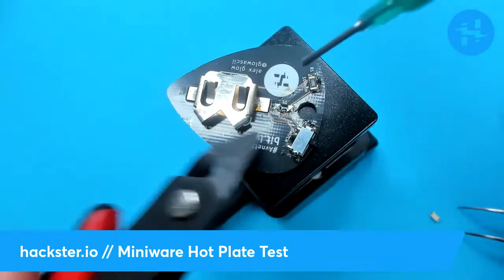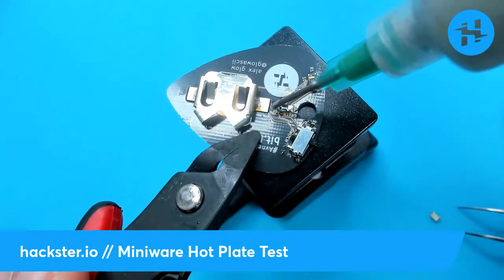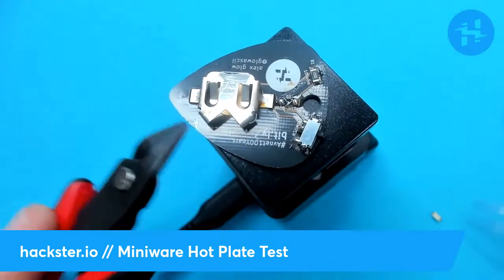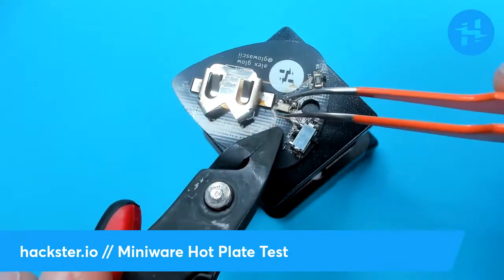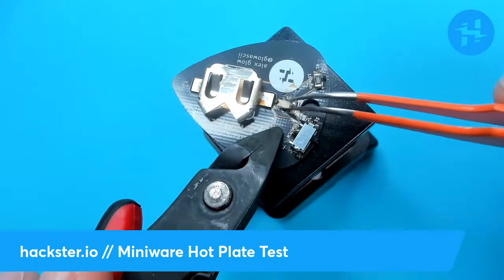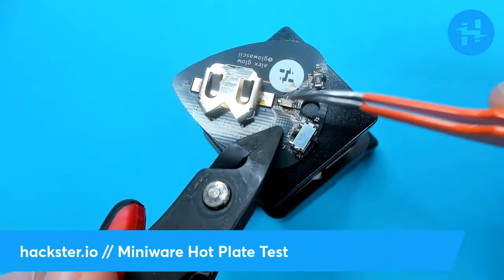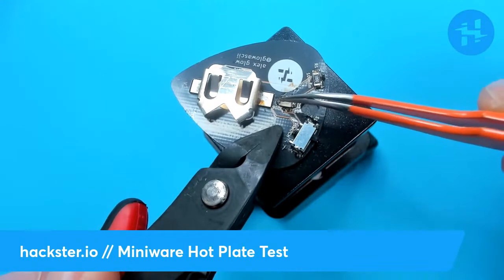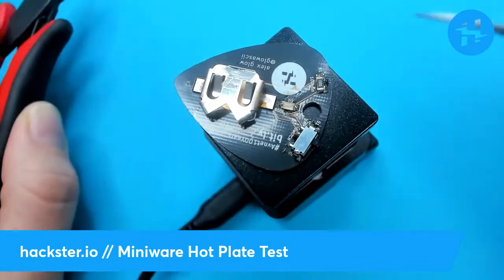Another one that I want to do is Oshwi, the octopus badge by Gustavo Reinaga — you can find that on GitHub, which is linked in the description below. I'm not going to do that today because I think I need to do a little bit more practice with small boards first and get used to the process of handling these things. You saw that I accidentally knocked the board off of the heater before, and that's not optimal. I need to get used to this before I do a larger board and come up with some strategies around that. Oshpark is wonderful — I get a bunch of my PCBs done by them. You can see that in the preview this is a purple and gold board, but in the actual one it is black. That's because they have this beautiful After Dark colorway, which is a black PCB substrate base with clear solder mask over it so that you can see the copper traces underneath. The exposed pads are gold color because they put that gold ENIG coating on top. It's a very beautiful colorway. I've got to practice how much paste to put on here — but you can see it's making some nice shiny domes.